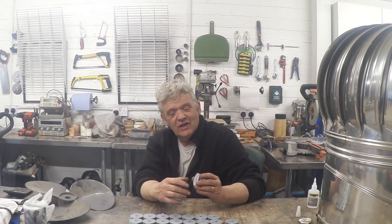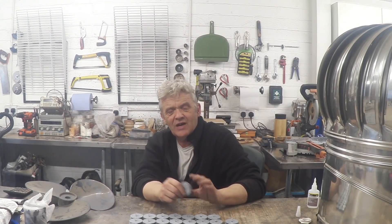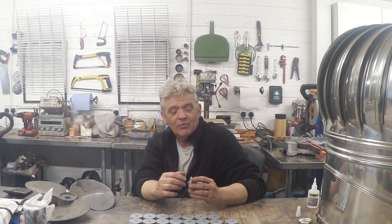The disc is also a bit starved of magnets — about a third of what will fit on there, because that's all I had. I've ordered 100 so I should be able to cram it with magnets and see a higher output. With a stronger magnet and stronger field you'd see even higher output. If we have 32 coils we can expect around 64 watts, which I think is quite reasonable — especially considering this is basically made from a couple of broken light fittings and broken microwaves. It cost me nothing apart from about three hours of time.